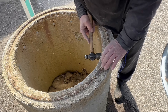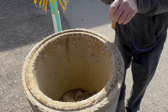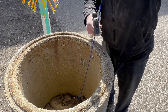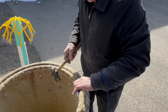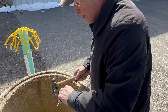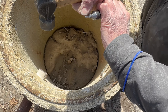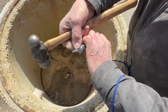They're all in the holes now. I've got a rope onto my driver so I don't lose it into the tank — I can retrieve it if I lose it. This is a nice heavy-duty driver. This is what sets the anchor. We're going to start right here and just start setting it. You drive it in until it hits this stop right here.